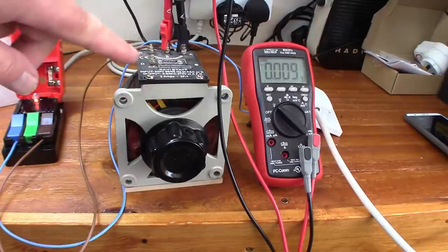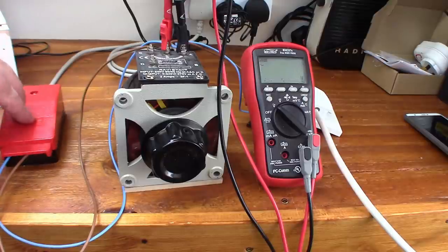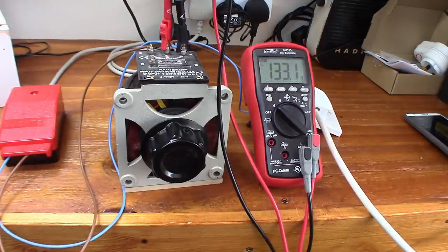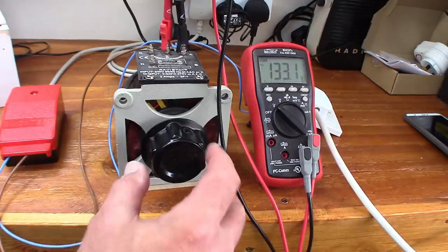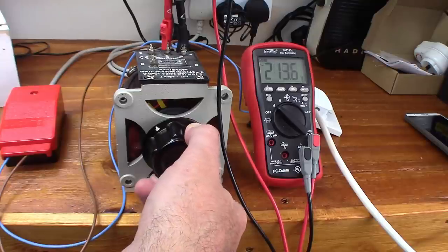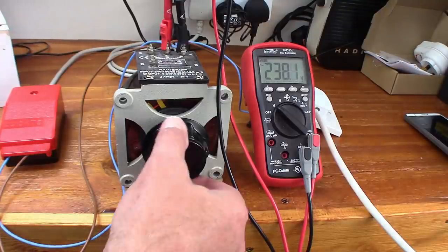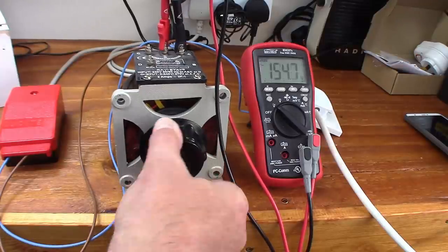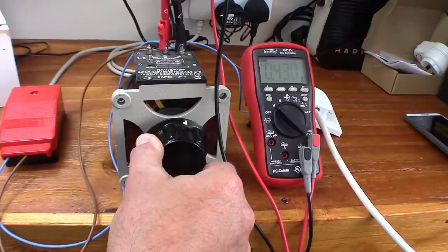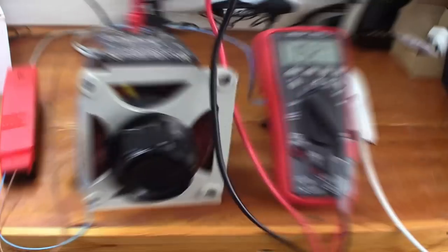Let's see what happens if we stick a multimeter on that and see what voltage we can get. The multimeter is clamped to the top of the terminals. Let's turn that on - you can see immediately the multimeter reads 133 volts. If we turn this clockwise, you'll see that go up, and at full rotation it says 238 volts, which is what we have in the UK. Turning it all the way the other way brings it down to zero - it says 0.3 volts, good enough for me.